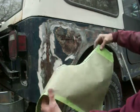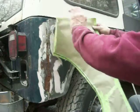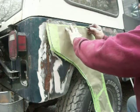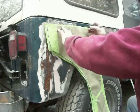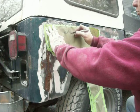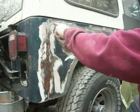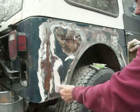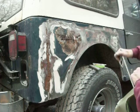It's kind of like an inner fender edge, and this pattern will be what I need to fit that. The only thing I want to make sure of — I want to add a mark here to add some metal over here — so I'm going to add three quarters of an inch along that edge so I can turn it and make it go back in there. Even though I'm going to cut it here and probably save this bottom, replacing the original fender entirely might actually be better.